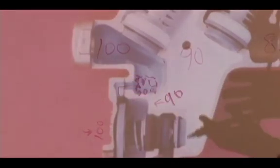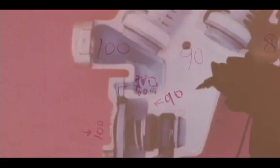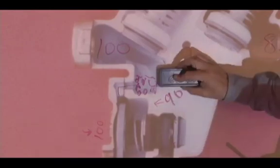Sure. What might happen is sometimes you'll see this type of relief valve jerk open and jerk close, which means sometimes that sensing line is plugged, causing it to act a little erratically. So that's why it's important to see that interface between the high and low pressure sensing line. Since we know there's a high and a low, we know that it's hydraulically balanced. We'll talk about the trip ratio in a minute.